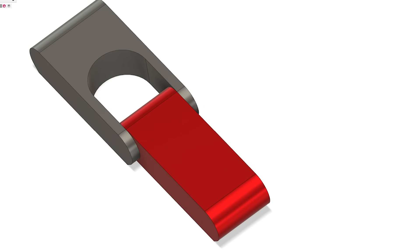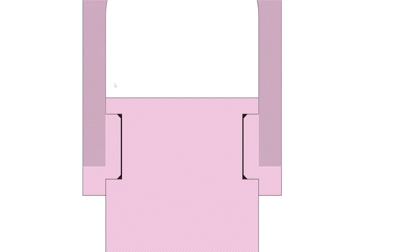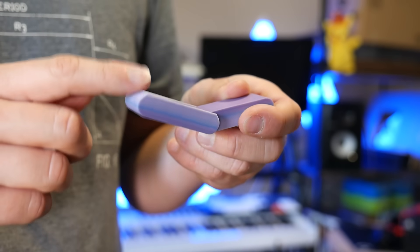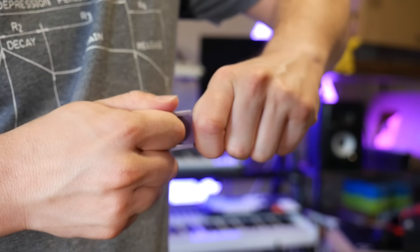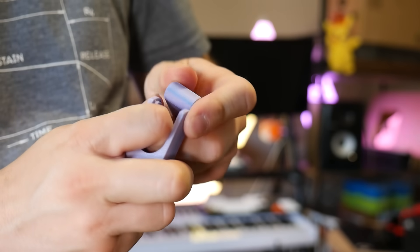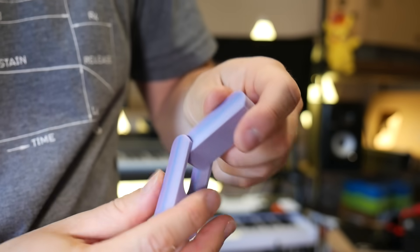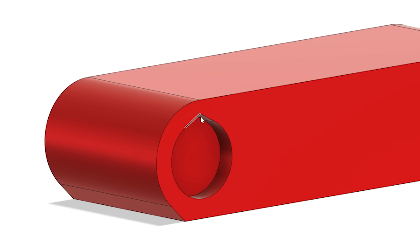This variation, however, has its edges at 90 degrees and needs to be manually flexed into position. This one tiny detail change results in a much stiffer hinge, and one that you would really struggle to pull apart, but it's also way harder to assemble. This version also has small design changes to remove the need for support material — it's got that little teardrop shape at the top of the bore, and a tiny chamfer at the bottom of the pin. Pretty clever stuff.